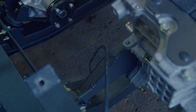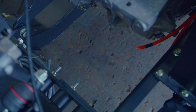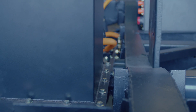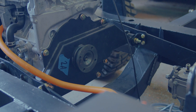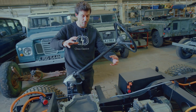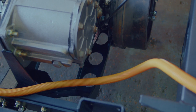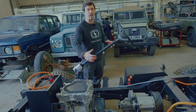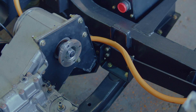That's doing a couple of things. It means we can use points on the chassis that are already there to bolt our frame straight into, and then have a load of flexibility about where we can bolt the rest of our system and put mount points where they need to be without cutting or drilling the chassis. It's also holding both the motor and the transfer box in such a way that when the motor spins, it transmits torque to the transfer box. The motor spinning is going to try and spin the whole transfer box, and if you don't have that mounted correctly, the torque is actually going to try and wriggle it free. Our rail system makes sure we've got a really stable mounting for the two to pass torque between each other.